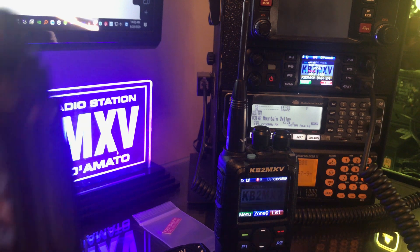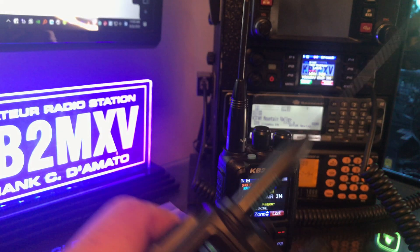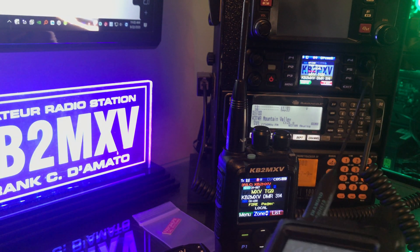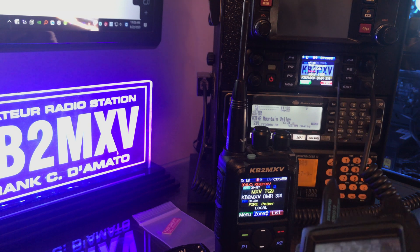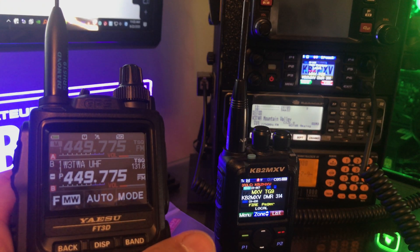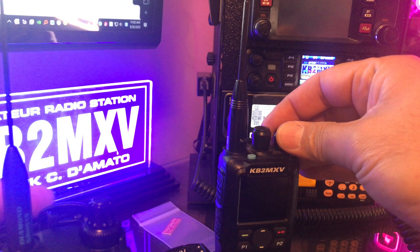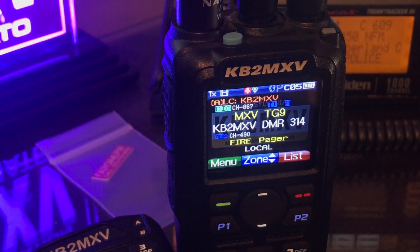Here I have my analog radio that's on that Mountain Valley repeater. I'm going to talk into Mountain Valley — Mountain Valley is going to relay that to the fusion side here, and this radio will do cross-band repeat into my talk group 9. So I'm going to activate the announcement on Mountain Valley and we should hear it come out on the AnyTone. Zoom in on the AnyTone a little bit — okay, here it goes.